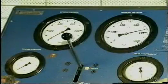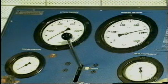The main objective of the normal tests shown in part 3 of this film is to ensure that the valves function at the correct opening pressures and that they seal tightly. As the injection capacity of the engine fuel pump is much greater than that of the pressure testing pump, atomization will be ensured during service, provided that the fuel valve passes the normal tests.